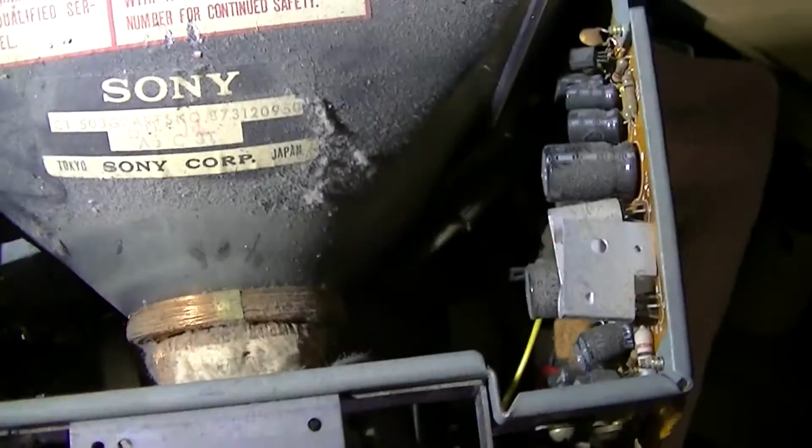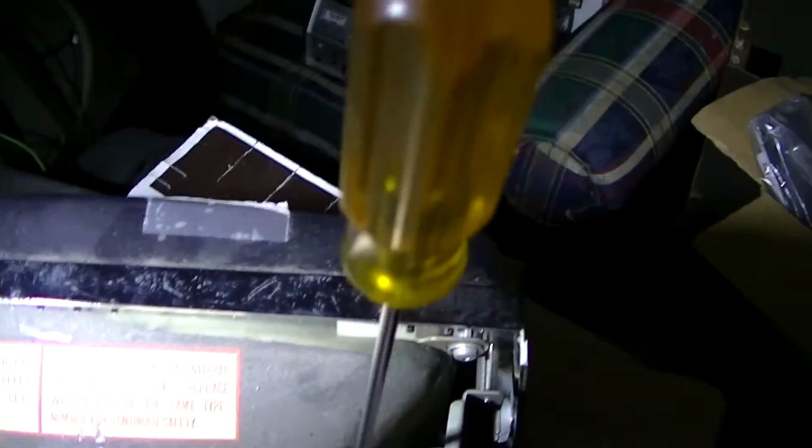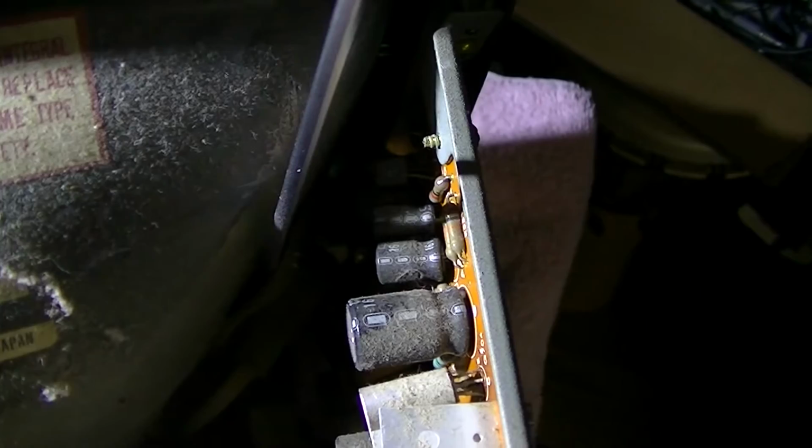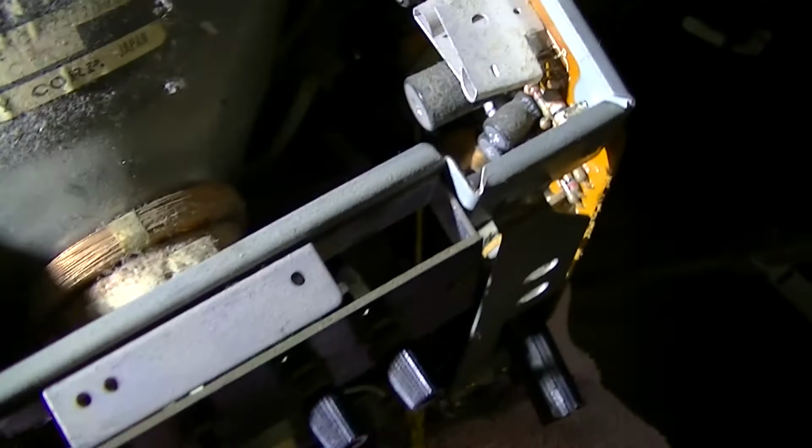Check and see if there's any high voltage. This is perhaps not the brightest thing I've ever done, but it appears there is some high voltage. Not much, however. About 8 kilovolts. Let me pull a Sam's on this and see what it's supposed to be.